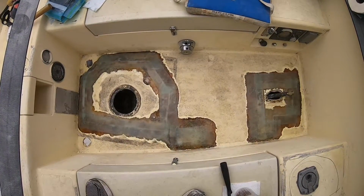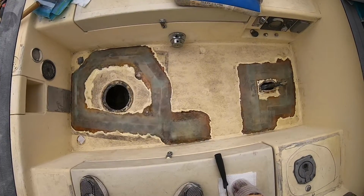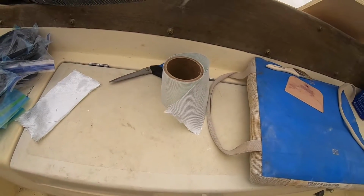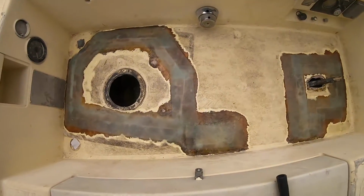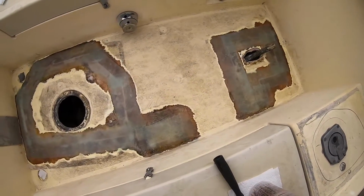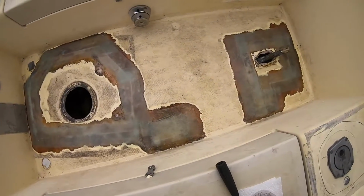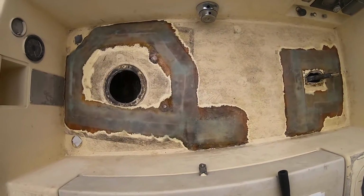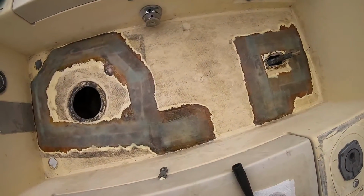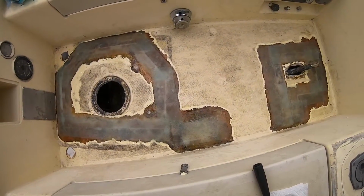And there is three layers of 15-ounce fiberglass, this stuff, whatever that's called, tape. It's 15 ounce. I got three layers everywhere. Some corners and overlaps have four layers. Some of that will be ground down when I fair, though, I think. But there we go. Just cure, then sand and fair. I'm done for the day.